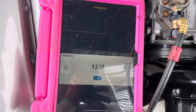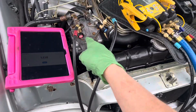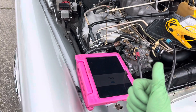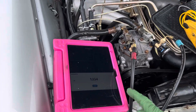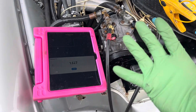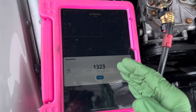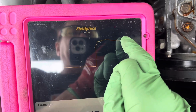On an analog gauge you can never ever see this. Somebody retrofitted this system, put a brand new receiver dryer on it, filled it up, shipped it, and said it was good to go. In other videos I showed you how many leaks are on here, which I could pick up with a good leak detector and soapy bubbles once I had 200 psi on there — not refrigerant. Refrigerant wouldn't find the leaks. Now we're stabilizing — we went to a peak and now we're coming back down.